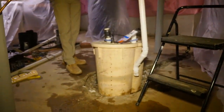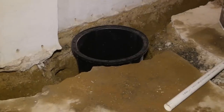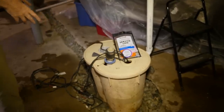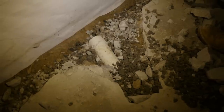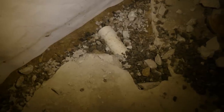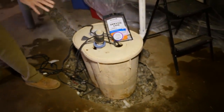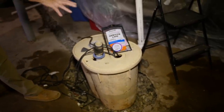What we're doing here is removing the pump. We're going to set up our pump station over there as part of the drainage along the wall, and we're going to close this back up and give them back this part of their basement floor as usable space. If you look over here, there's a trench — it had a pipe in it that was connecting the drainage on the wall over to where the sump basket was. We've already pulled this sump basket up; the top of it was flush with the floor. The idea was that water would collect in that gutter, travel through this pipe, and get over to the sump pump.